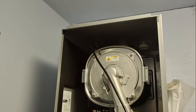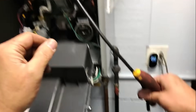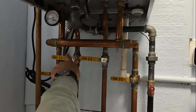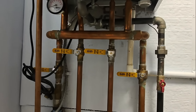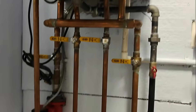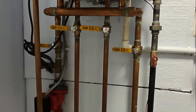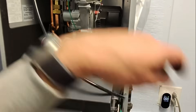We have a bad circulator. I'm going to release some pressure from the boiler by opening up the bleeder hose valve into a bucket. Unfortunately this installer did not install any flush valves anywhere — not on the tankless domestic cold water and hot water outlet, which is also missing. We're also missing a temperature and pressure safety valve on the domestic hot water. Not too bright of the installer — there's no way to ever service this system unless you cut in tankless flush valves.